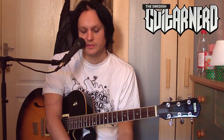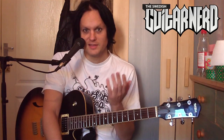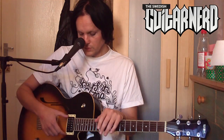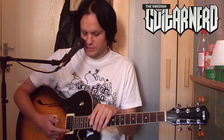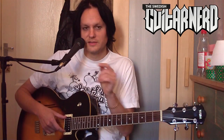They're all made to reduce unwanted noise. The thing is, with electric guitars you have magnetic pickups, and by design they make noise. They started with single coils — you can see these two here — and by their construction they make a special noise. When you put two of them together and set their polarities differently and wind the pickups in different directions, that noise cancels out.